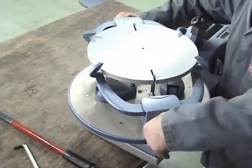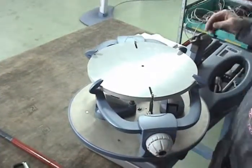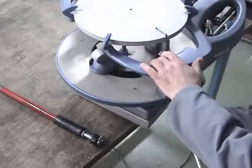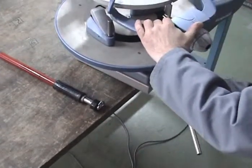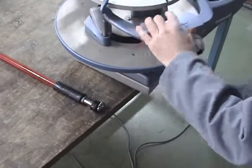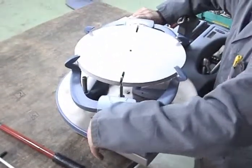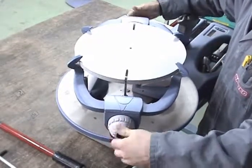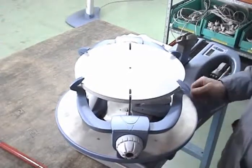Check again if the movement of the billiard is perfectly free. Now we will tighten with a special key, which is a number 10 Allen wrench plus a special tube. Tighten the screw a first time — the final tightening will be made with a dynamometric wrench. Always be sure that the movement of the billiard is completely free.